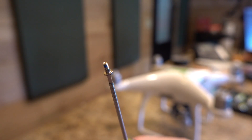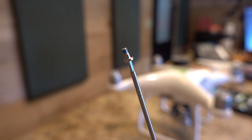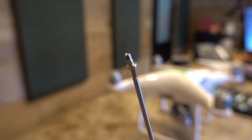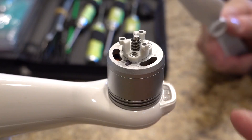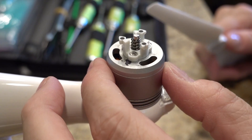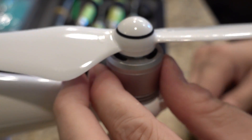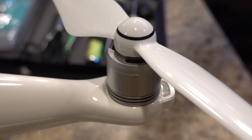One more thing: these little teeny-tiny screws will have a bit of the factory Loctite substance on them. You might want to put a little itty-bitty dab on each one, as these parts will be rattling around quite a bit. And now your Phantom 4 motor is equipped with a Phantom 4 Pro bracket and ready to accept the much better attaching Phantom 4 Pro Pellers. Haha — Phantom 4 Pro Pellers!